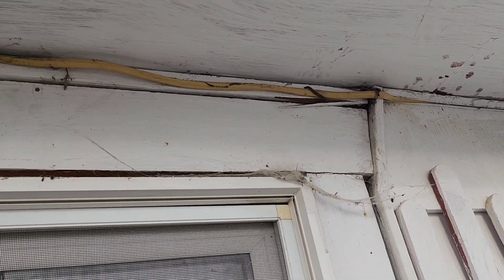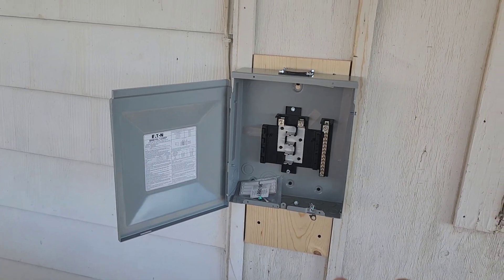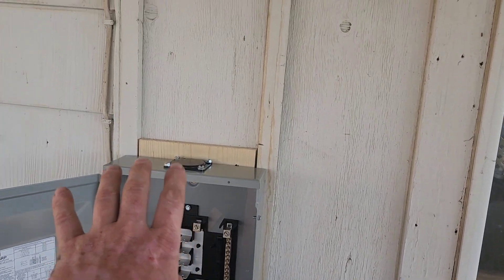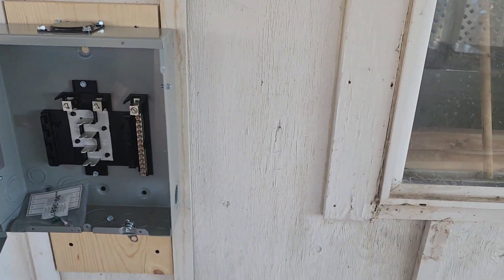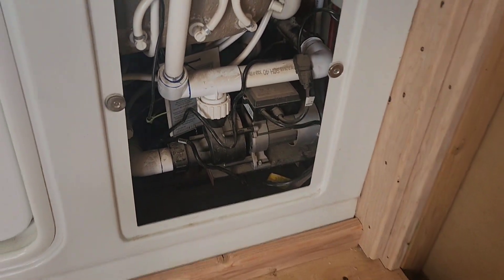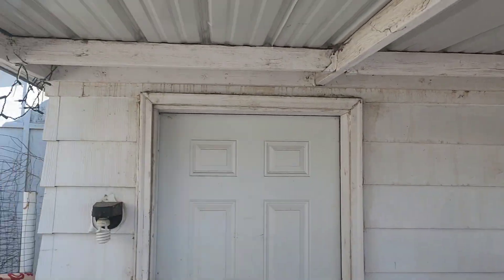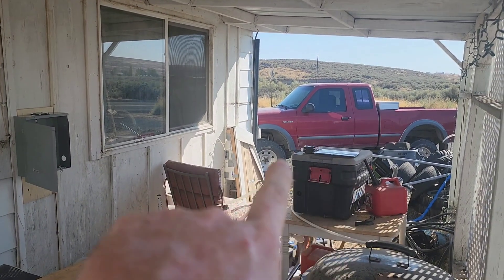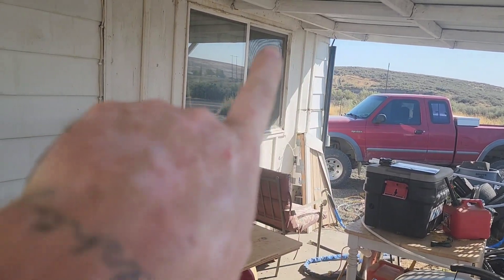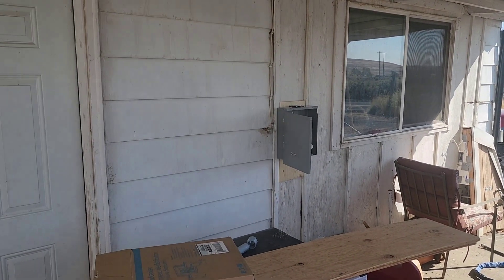This house is kind of funky. It's got wires nailed up underneath the eaves going places — holes drilled in the walls. One of the reasons I'm running a whole separate panel is because we've got a hot water heater wire literally going in through the wall. We also need through-the-wall outlets for the tub, lights, and outlets. I'd also like to run power to the shed. It just seemed easier to run one big wire to a new sub panel and wire everything closer, spending less money on wire in the long run.